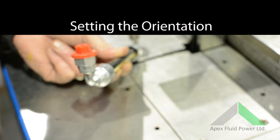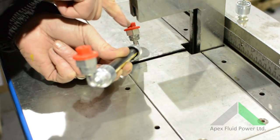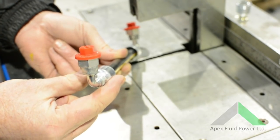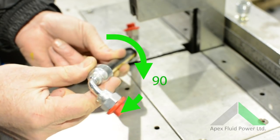Finally, if we need to set the angle on the assembly before swaging, this is done very simply. The end furthest away is set pointing upwards, or zero degrees, and we rotate the closest end to the necessary angle, such as 90 degrees or 180 degrees.